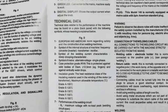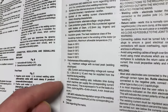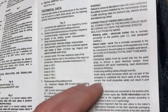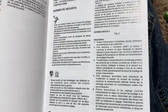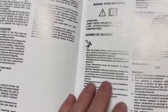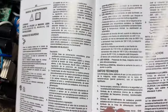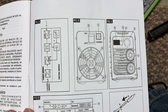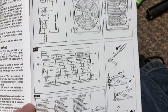There's technical data here — this specific machine has grade H insulation, which is rated for 180 degrees centigrade. They show you formulas for calculating the specs on that bottom sticker, along with warnings about the electrode holder and things to avoid. Then it goes into French, the same version in French, and when we get to the back, here are the instructions in Spanish, along with the diagrams they were referencing in the text.